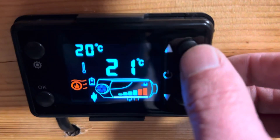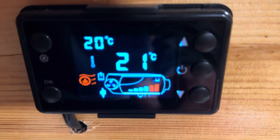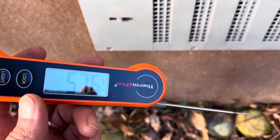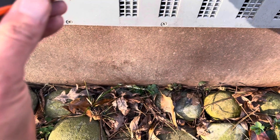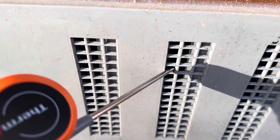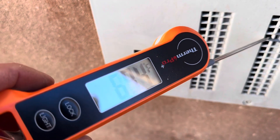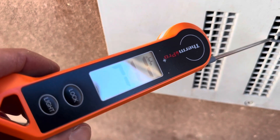It keeps it from carboning and sooting up. It's running on street diesel right now — no big deal. Temperature-wise, you can set it up or down. The floors are getting very warm, so I'm going to get a quick crawl space temperature reading here to see how fast it goes up. I need to fine-tune tonight to not create too much positive pressure under the crawl space.